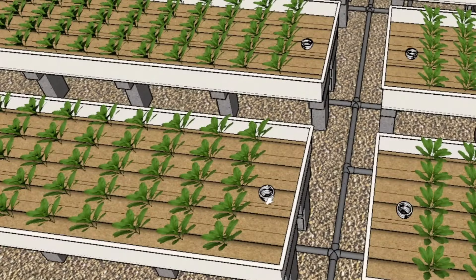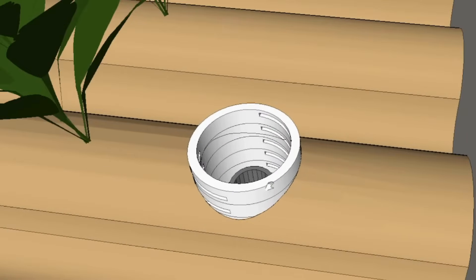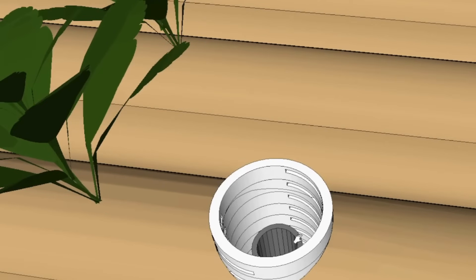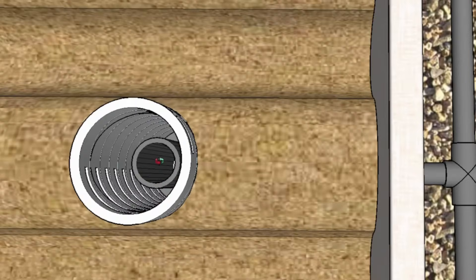The outlet is very simple. You have a 110mm or 160mm pipe that prevents the sand from going down into the down pipe. The down pipe is a 50mm pipe that goes all the way down, and on this 50mm pipe you've got a small 10mm hole at the bottom that allows for slow drainage of the water back into the fish pond.